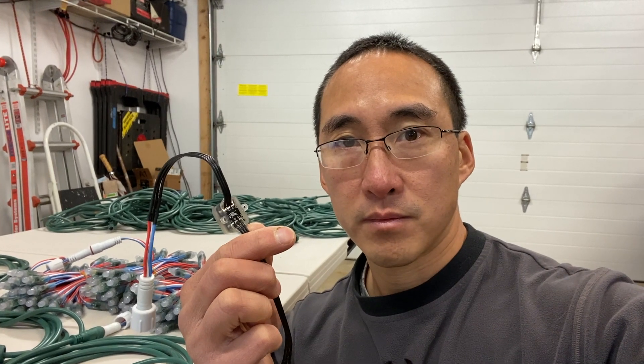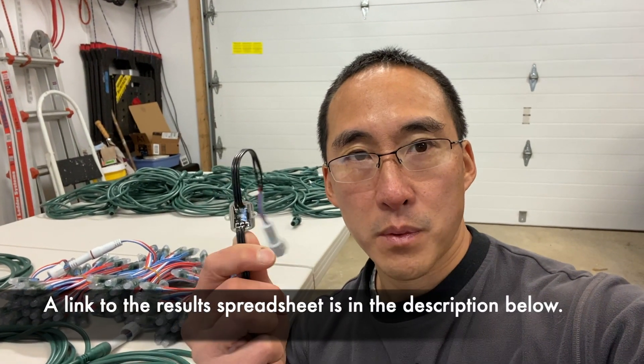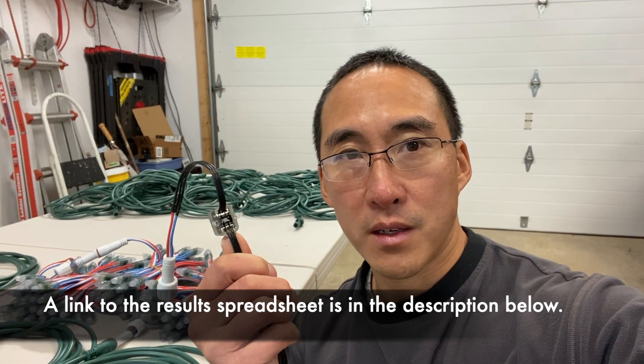In summary: data can be sent from a single pixel anywhere from 30 to 40 feet, regardless of brightness or number of pixels. Adding an F-amp significantly increases how far the signal can be sent — ranging from 100 to 250 feet or more, depending on pixel count and brightness level. Even with an F-amp, that range is very dependent on how many pixels are being driven. The power drawn by a large pixel count uses the same shared ground line as the data, causing noise. So even with an F-amp, the 250-foot range can drop down to 100 feet just by powering more pixels, even at lower brightness. I hope this helps — enjoy.